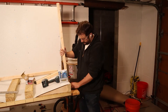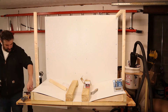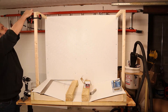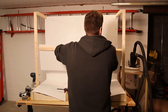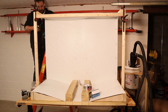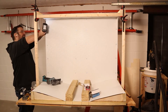I wanted the enclosure to slope from front to back towards the top so I get better runoff of coolant or whatever liquids end up on the side of the frame. There'll be a taper from the bottom all the way to the top of those 3-foot high 2x2s in the middle. I measured the mill to make sure that once I do that it works out, and there's going to be a lip about 12 inches high from the bottom to make sure there's clearance for all the mechanical parts on the mill. I cut another 4-foot wide by about a foot deep piece of that white plastic and screwed it in, then put a 4-foot wide piece of 2x2 at the back to square off the very top of the frame. Adding roofing screws working from the middle towards the outside got rid of all the bulges.